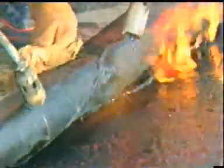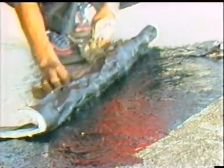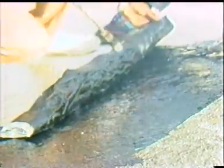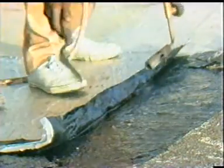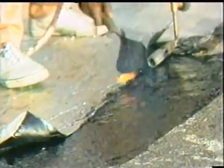Heating by blowguns results in melting of the polymeric bitumen layer of the Multiplus sheet and the primer coat of the prepared roof surface. This molten material moves along the roll and causes bonding of the Multiplus sheet with the roof surface by fusion. This makes the roof surface waterproof with Multiplus treatment.